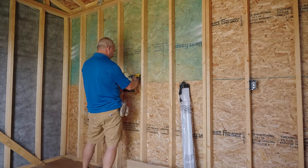I like, with my Olfa knife, this is how you measure. Okay, perfect, you put the blade out, it's the length of the knife. It's always the perfect amount of wire in a box. It's a great cheat, especially if you're not an electrician like I am, not. Just a handy guy who's done a lot of work on his own electrical, on permit. I never get any kind of an issue with it.